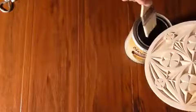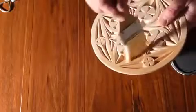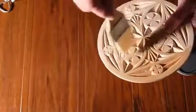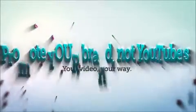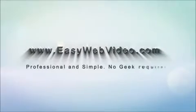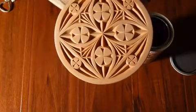Apply the sealer and get it into all of your carved recessed areas. You can see I'm applying quite a heavy layer and it absorbs and soaks right into the wood. Now we want to be sure to seal basswood because if we don't, it's very spotty when we apply a stain or any type of top coat to it. I'm going to be sure to seal the sealer — put this aside for about 30 minutes, flip it over and seal the back.